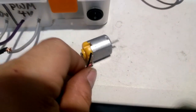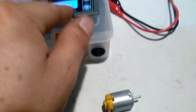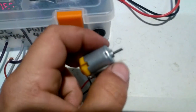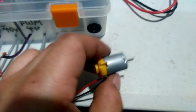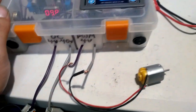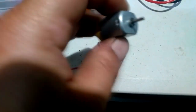And that's simply because now we're at such a high frequency that little 1% blip throughout each pulse has nowhere near enough current in it to really get this rotor moving. It's really just going to start ringing the coil like it's doing here. I can turn the voltage up. The ringing becomes more intense. But that's about it.